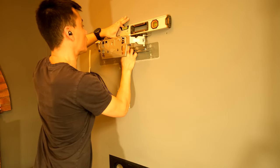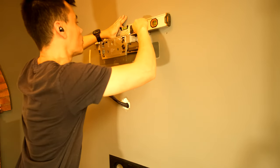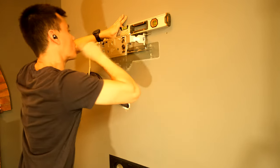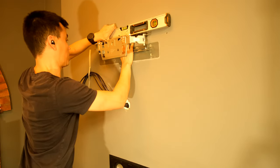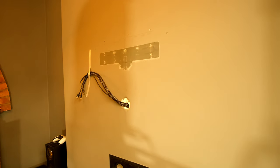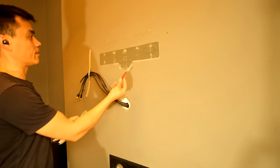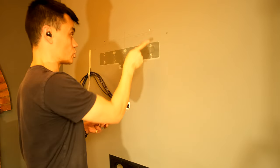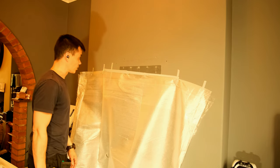I like to put a spirit level on the top as well, even though you do have quite a bit of play on this bracket itself. I'll just mark these slots quickly. So I've got about 12 fixing points there that I can use if I wish to — it gives me 8mm by 60mm fixings. I'm going to try the supplied ones and drill in, and just dot those fixings about. I've taped the TV sheet just under where I'm going to drill, with a dust sheet below that on the floor, so the dust should fall down and onto that dust sheet.